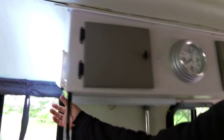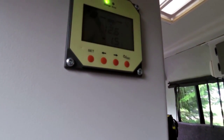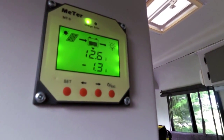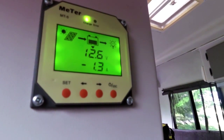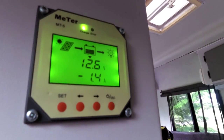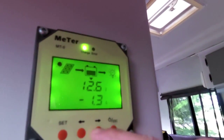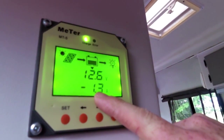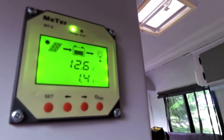What I can do is just manually turn these guys off, which you're supposed to do anyway. Then we look at the power draw — it's migrating down. 1.5 amps is what the transformer says it uses. Now it has the heater on because I had the top off and it was cooling, but 1.3 amps. It would be a little bit more efficient. The light bulb icon is the actual draw out of the charge controller, as opposed to this value here which is how much it is drawing in from the solar panels. So the actual draw is 1.4 amps — that's not bad, and that would be more efficient than the transformer I just pulled off.